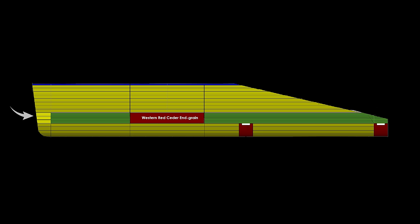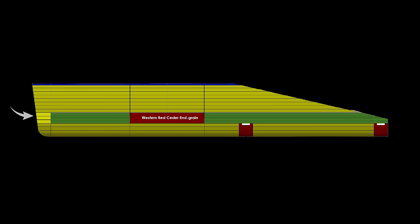All the strips had to be cut into five basic lengths: 200 millimeters for the end piece, then 1,050 millimeters up to the first break point, followed by 800 millimeters to match the length of the western red cedar in the spine, and finally 1,850 millimeters on the trailing edge which will be cut at an angle later. On the leading edge there are two red cedar inserts for where the two sheaves will be located, requiring foam cuts at 400 millimeters and 1,300 millimeter lengths.